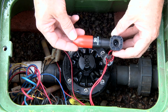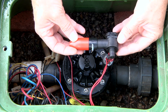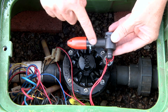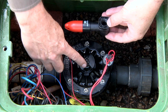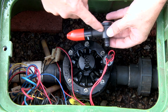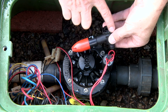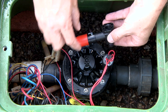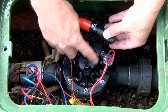We'll be installing this 30 PSI preset AccuSync model. One thing to remember: the sideways regulator is independent from the center shaft. So if you're curious how you're going to thread this onto the bonnet with this long perpendicular piece, the center shaft is independent from the right angle handle. As the solenoid goes in, the center shaft will spin in place, allowing it to insert into the threads on the bonnet. When you're finished, you can relocate the perpendicular part to anywhere that doesn't get in your way.